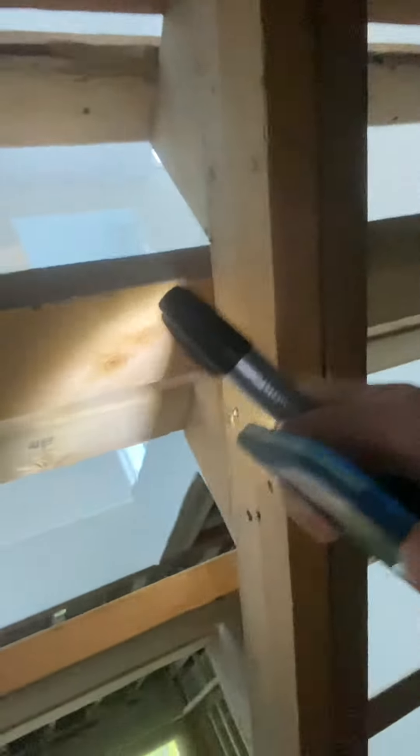Overcutting affects your heel cut and support, and it weakens the stringer. Some people come in here and they'll do a two-by-four splice. Now the code doesn't say anything about splicing them, but a lot of times if they are going to splice them, you normally do them on both sides and then on the outside one. Just be something to look for when you're looking at stair stringers, and also consistency with the steps.